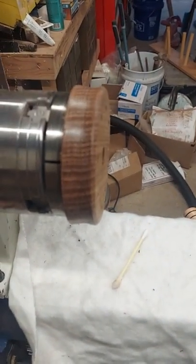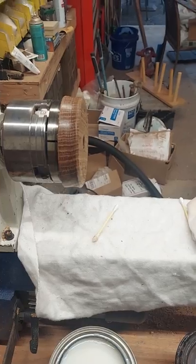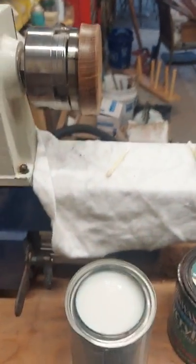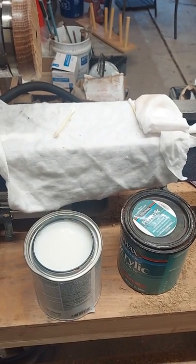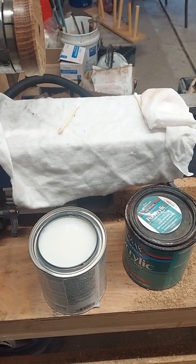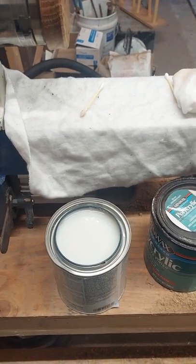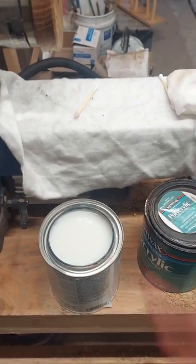I hope this helps. You can use just about any finish, but I like the spar urethane and this polyacrylic. The spar — I've used it in oil base — the one thing I don't like about that is if you use it on lighter woods like maple, which is almost like a white board, it will tarnish it to an off-color white. So I would rather use the polyacrylic on my curly maple; it will help keep that beauty of the wood looking good, because this actually dries clear.